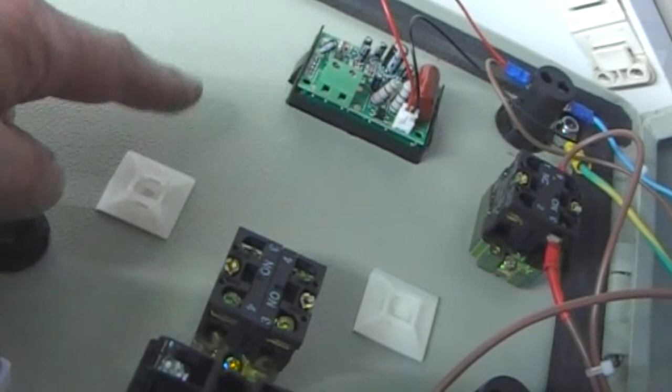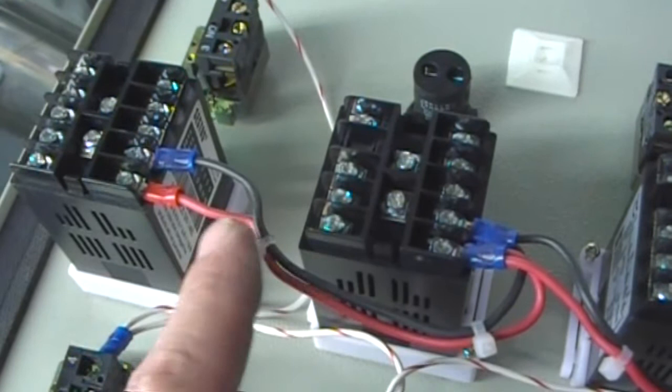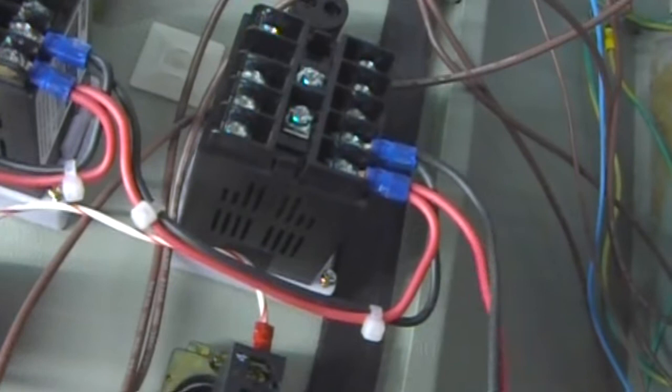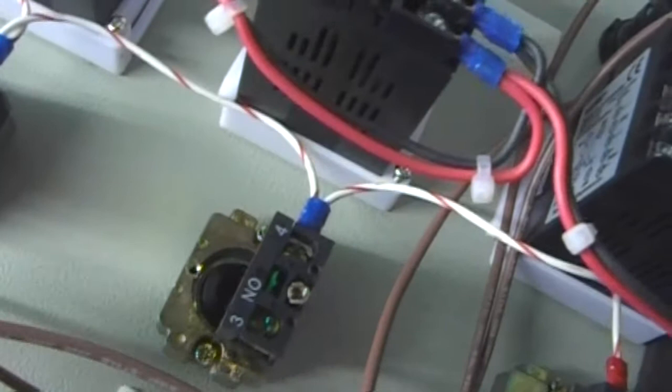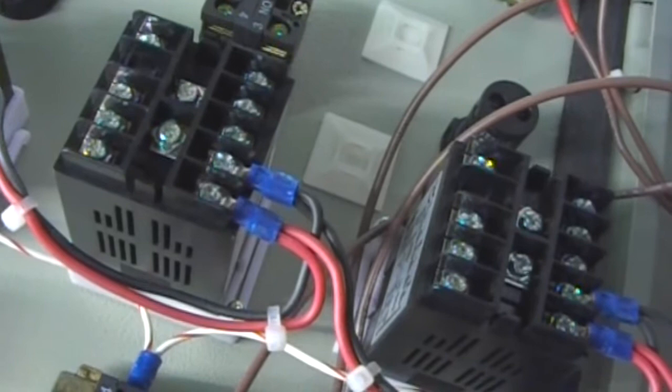We've come in to feed the power supply, the mains in to the SSRs and the timers. Obviously they can be looped around and come off, and then they'll go back directly to the distribution point. And we've got the first section of the alarm wiring. The next one obviously comes out and goes to the terminal on the back of the PIDs.